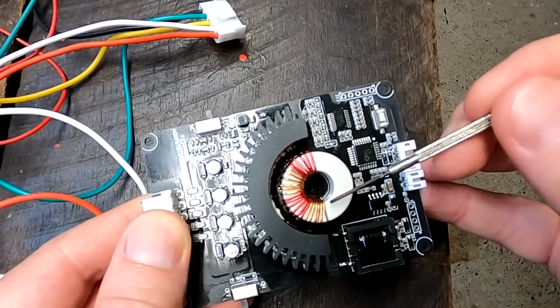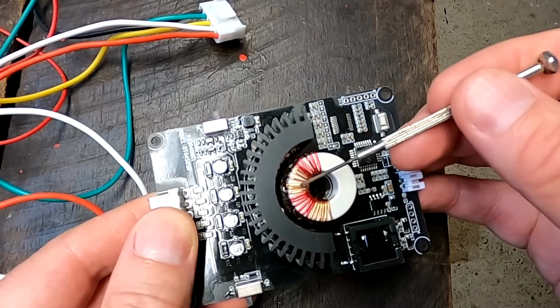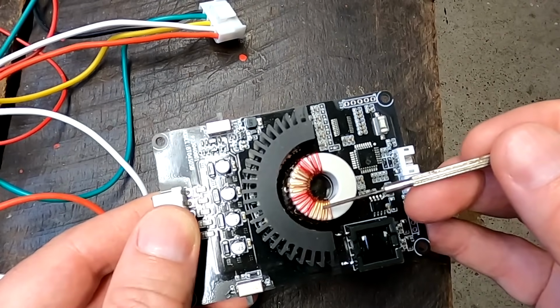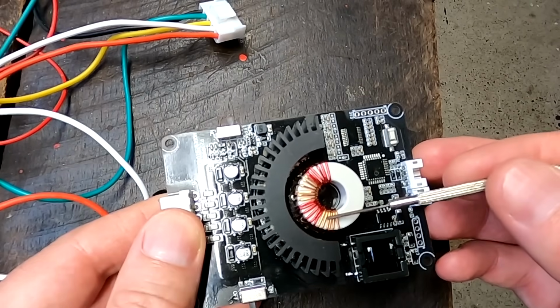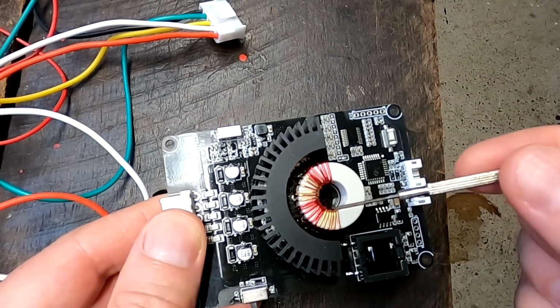And you probably can see the different colors of these coils here. Yeah, this is like a copper, this is red, this is copper, this is red again. So we've got one bunch of coils for each battery cell. And how this roughly works is each battery cell has their own transformer coil. And the higher your battery voltage is, the higher the voltage in the transformer.